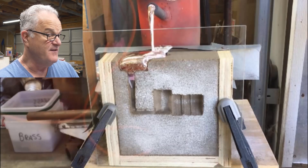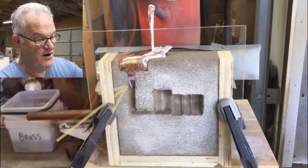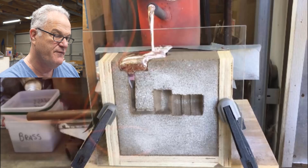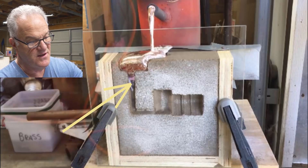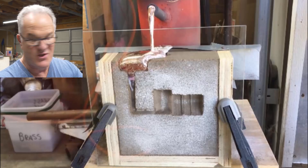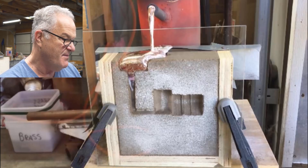The plug has started to melt. You can see here the smoke that's coming down along the side, and right behind it I'm going to go just a few more frames. Right behind it, you're going to start to see the metal fill the sprue. And right there, right in the back edge of the sprue, you can see the metal starting to come down behind. You still see that smoke sort of leading the charge, but the plug has started to dissolve and he's got the metal coming in.